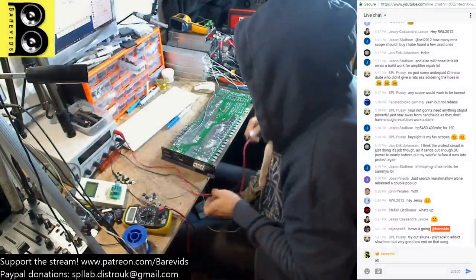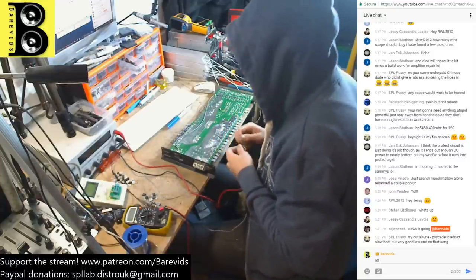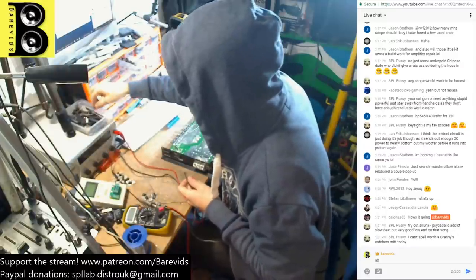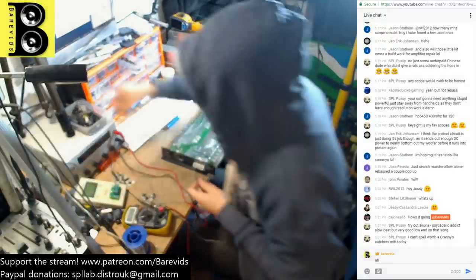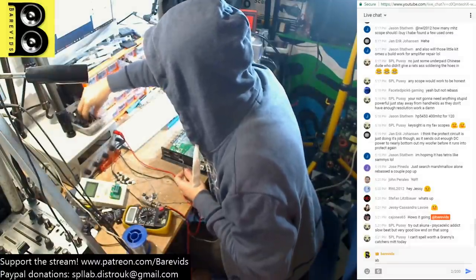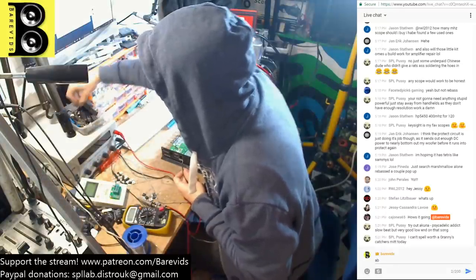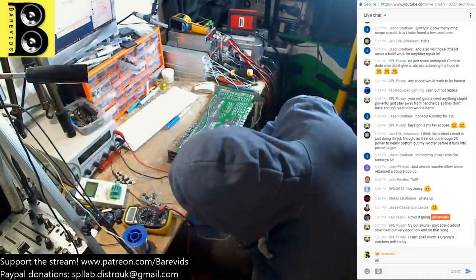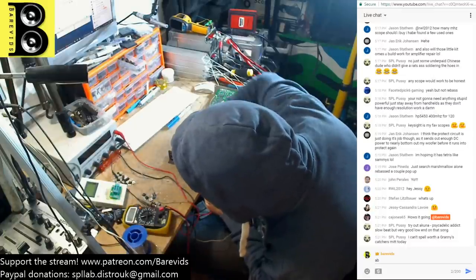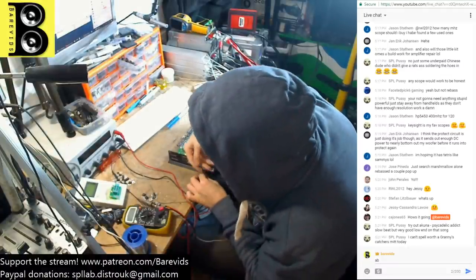On one of my previous live streams though, it did kill some power supply FETs that would not have been killed had I been using my old small 5-amp power supply. But I think that's just a payoff. If you're using a nice, high quality adjustable bench power supply, even though the current limiting on it is quick, it's not quite quick enough to not blow the power supply FETs if there's a serious drive issue, and that happened on the Lanzar. If the FETs all get turned on at once, the only way they're going to survive is if the power supply literally cuts out at the exact same moment, which the small 9-volt 4-amp power supply did. It cuts out straight away because it physically can't provide the current, whereas this current limiting one can provide the current, but it will limit it. There's a small delay before the limiter kicks in, and during that delay it supplied the current for like a nanosecond, which did kill the FETs.